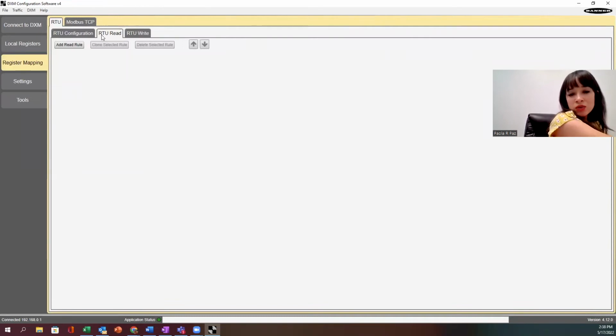And before I start doing my read rules and all of that, I need to make sure that all of my devices have the correct ID. In this case, to do that, we have to hold on here for a sec. And you've got to get this cable, right? You might already have it. It's the BWA-UCT-900. It's a special dongle that we use for RS-485.